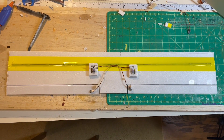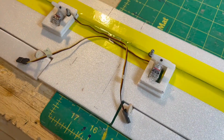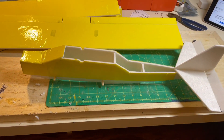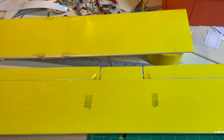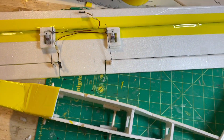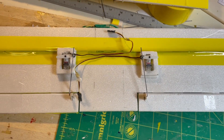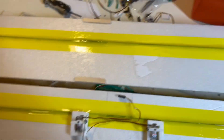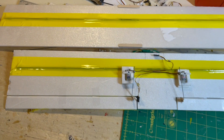This is another view of the wing with the aileron servos installed. I just use regular Hitec HS40 servos with a wide connector. No flap rods in this model — just normal ailerons on the top wing. I'm also experimenting with using strapping tape to cover the wings and the fuselage sides. Strapping tape is lightweight, goes on very easily, though you'll have to practice with it to get the technique — it's quite sticky. Here we can see the ailerons connected to the aileron servos, with lines showing where the fuselage will go. The top wing is glued in place; the bottom wing is held on with rubber bands. You can see the popsicle sticks on the bottom wing just to keep the rubber bands from digging into that very light foam board structure.